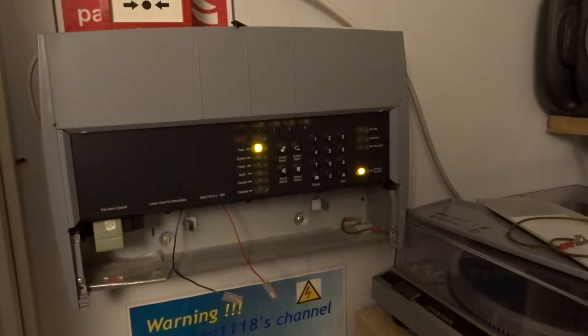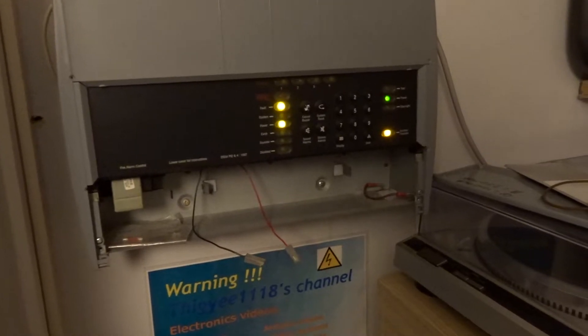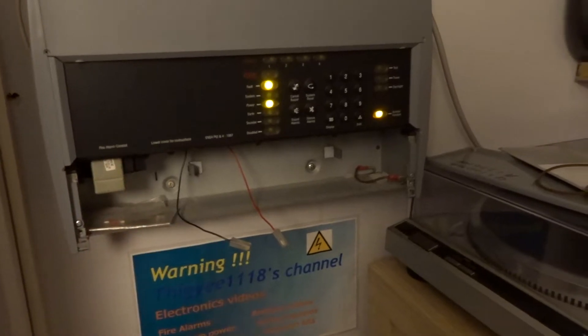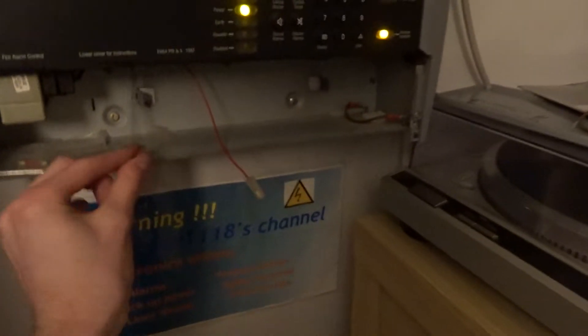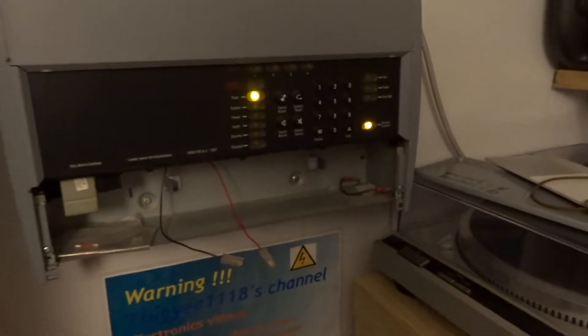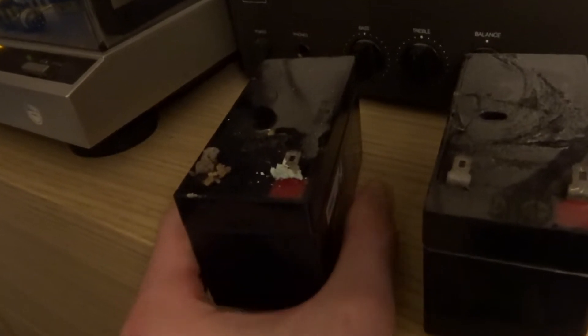Fully powers off the panel. Put that back on and it goes back into alarm. So I thought, okay, must be the batteries. The transformer here is relatively warm but not overheated. I took this panel off about a couple of weeks ago, silenced it, and it stayed silent — surprisingly enough — didn't go back into alarm until today, two weeks later. So I came over here wondering why it had suddenly come back into alarm, thinking power blip. And then I picked these batteries up and they're very hot — these are still hot now.